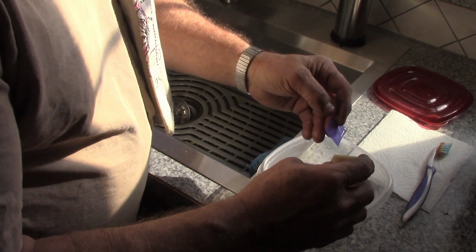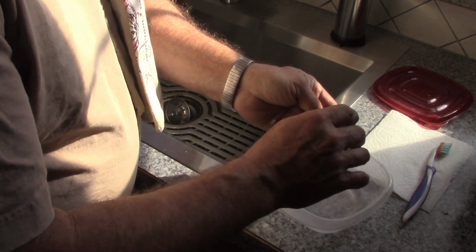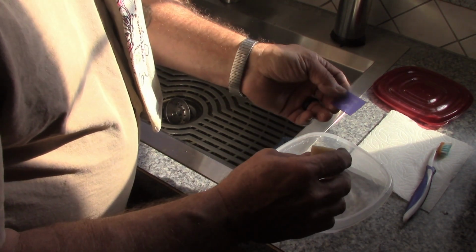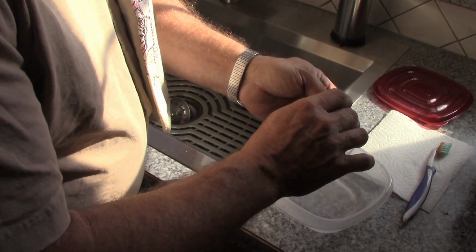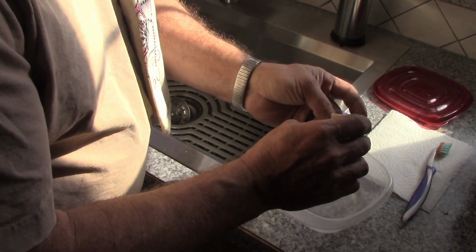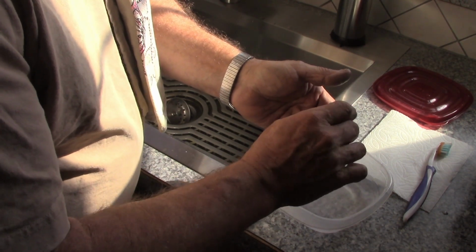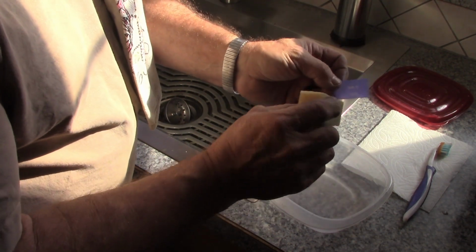You just have to kind of decide how much you need to scrub and how many times you're going to use this stencil. If you're going to use them a whole lot, you want a fairly durable stencil, and the more you rub, the more of the coating you're developing off. But a lot of times if you do that, it'll take quite a bit to get the stencil to start feeding this etch solution through it and get a good etch all over, because you want it cleaned out in between.